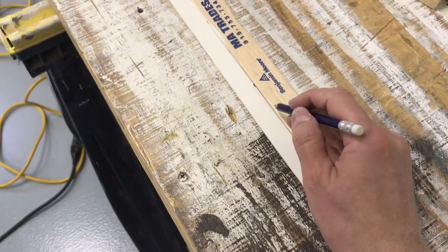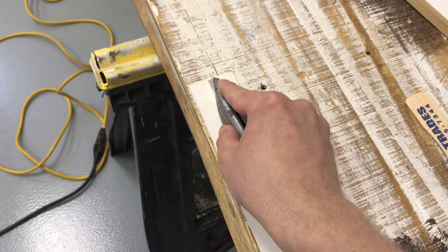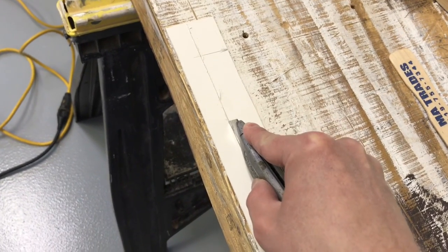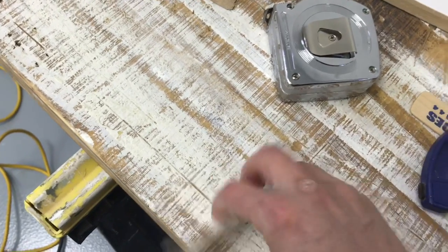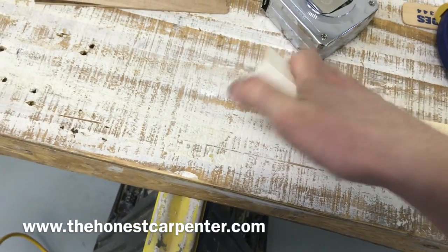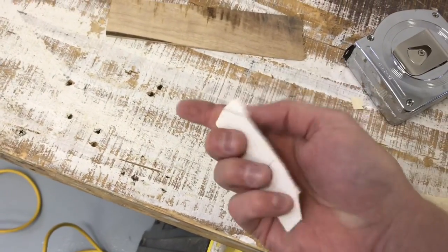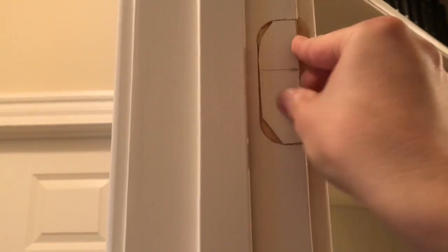My inserts need to be about an inch and a half wide. I make little marks with my tape measure and pencil, then use a straight edge like a paint stirrer to connect those marks. I go back to my Stanley utility knife to gently score the line, then measure out 3.5 inches for the length of each mortise insert, mark that line, score it, and cut it with the utility knife. I use the edge of my table as a hard edge to break the piece. Then I put little dog ears on it with the utility knife — these let the piece slide into the hinge slot more easily because the corners of the hinge slot are rounded over with 3/8 inch round-overs.